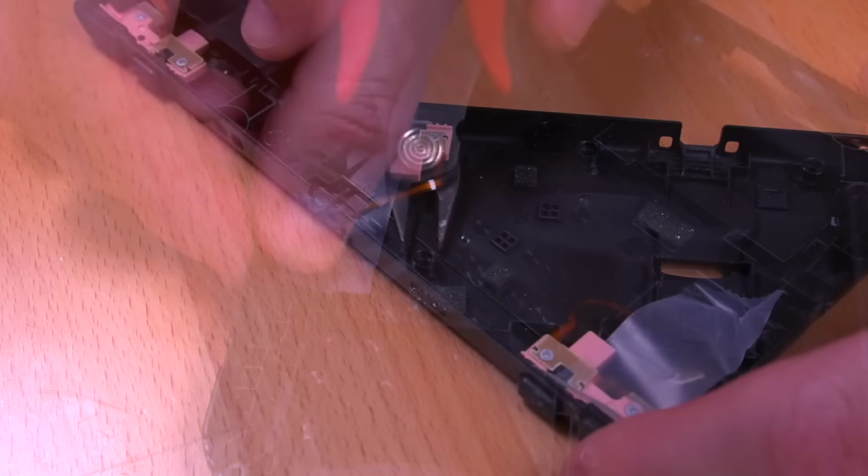I used the photo on Loopy's website as a guide on what I need to route away. And then I began to trim the shell, making sure to go slowly and hold the shell firmly so that it doesn't slip away. Again, go slow, wear eye protection, and take your time. Every so often, I would take a vacuum to clear off the shavings so that I can see where I need to trim.